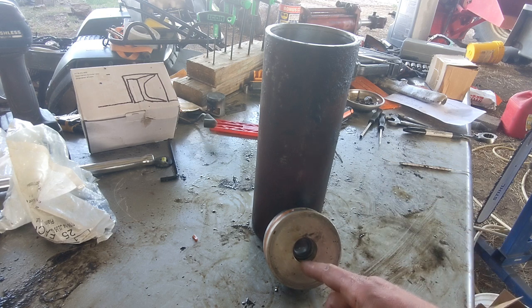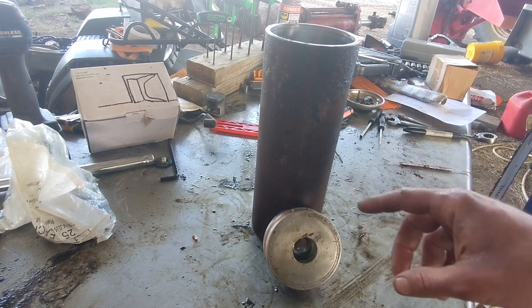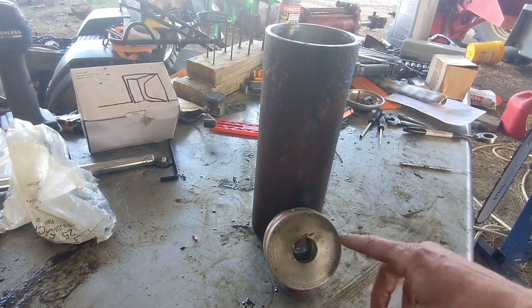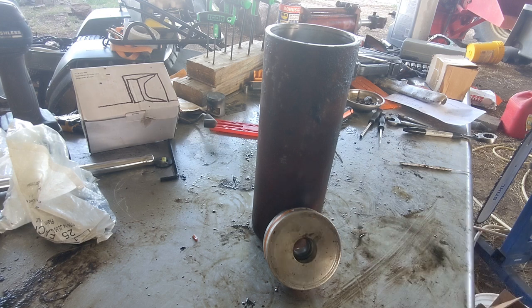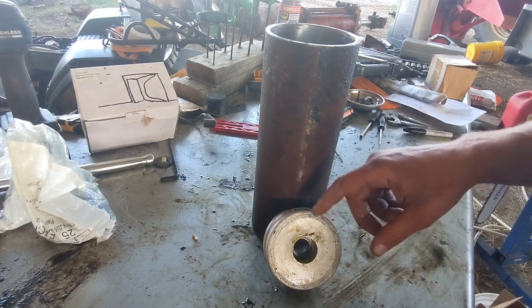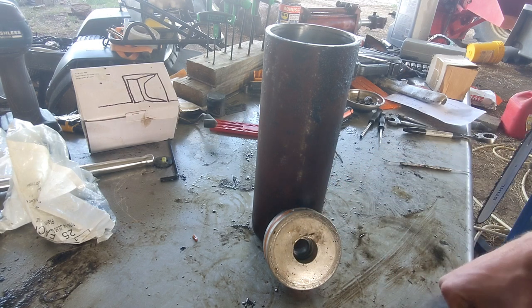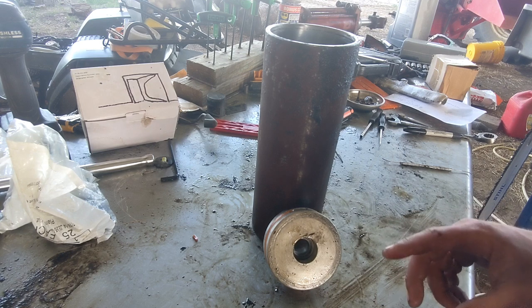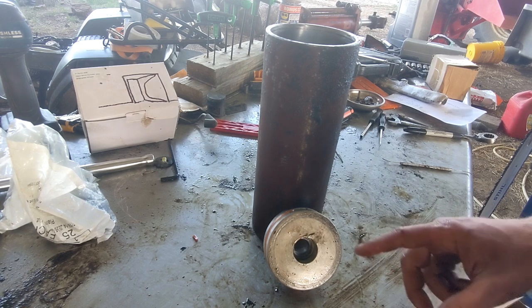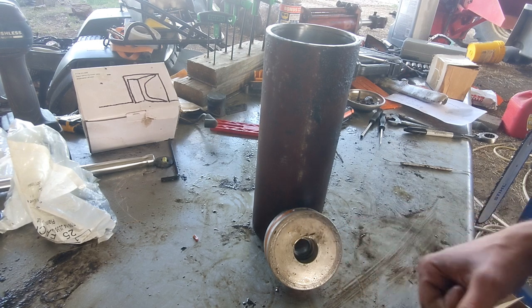And so this side will always be a little bit weaker than the other side. But if you get a new piston or a new cylinder and the rod is bigger, then it decreases that even more. So now, if you don't change both of them especially, but even if you do, you're going to have less available force in the retract direction of the cylinder, right? And if you leave one of these in service and replace one of them, if this is bigger, then you have unequal loading, unequal force being applied to each cylinder. Because of the way those are connected together, it's still going to work correctly, but you might find that you're breaking those plow bits that are replaced frequently. That's because one cylinder is just pushing harder than the other.